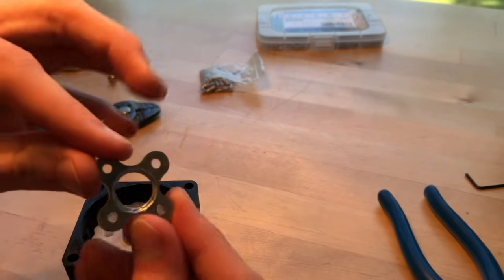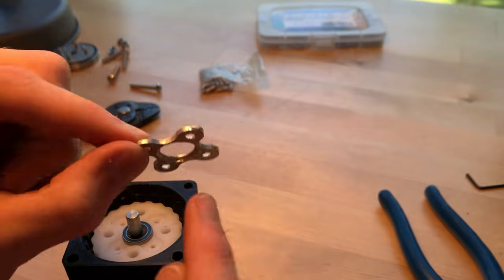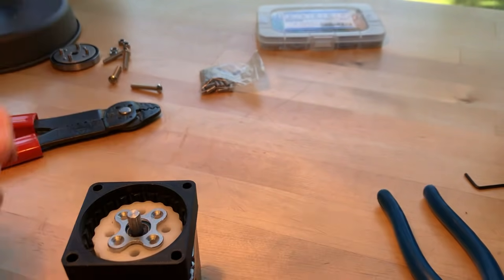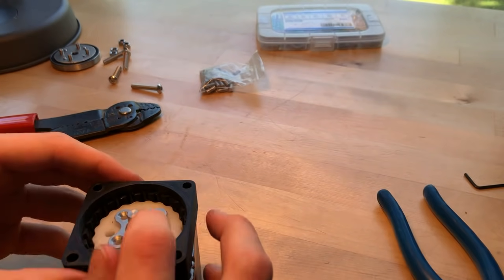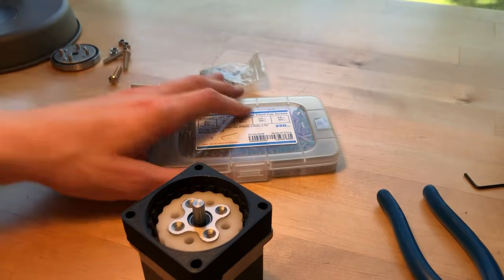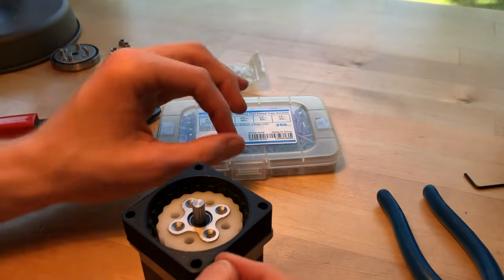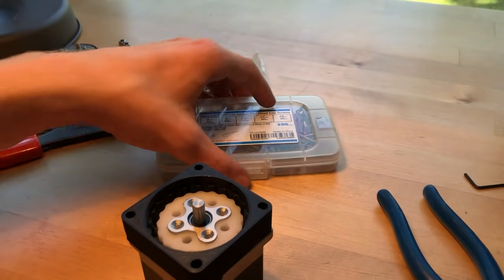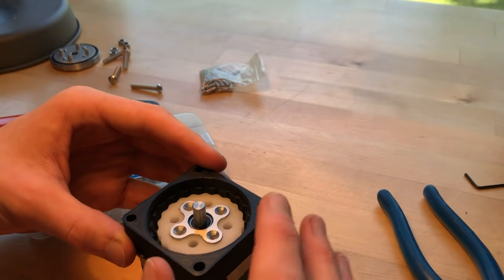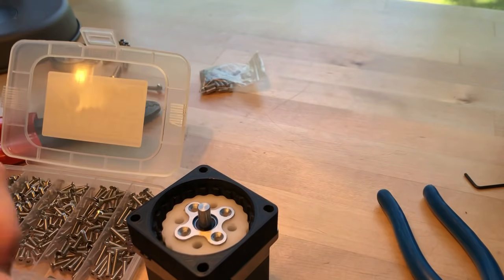Now I've got this aluminum piece with four corresponding holes, the same shape as that recess, which has another lip on it that'll clamp onto the top of that piece so everything can be held together with those screws. So I'll press this guy into that recess, and I'll take four more of my M3 screws and screw them in there. I won't be able to torque it down too tight because this is just plastic threads here. And also this cycloidal disc, this material is Delrin. I wanted to use Delrin because I know it's a good bushing material, so it should lower friction a little bit. Which one do I want to use though?